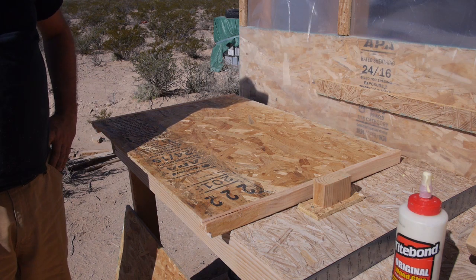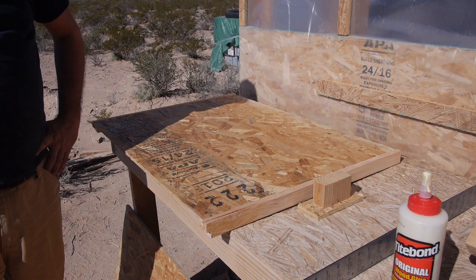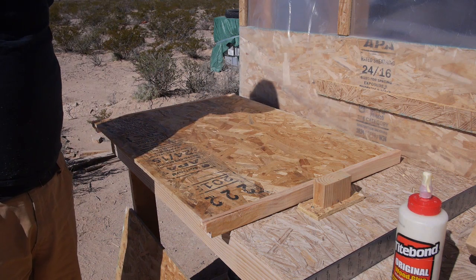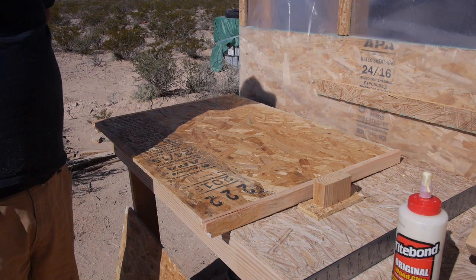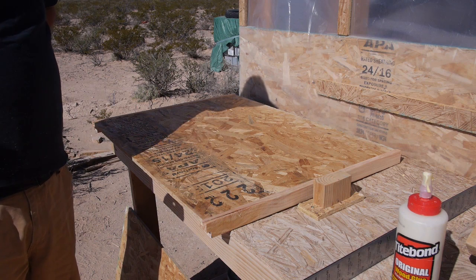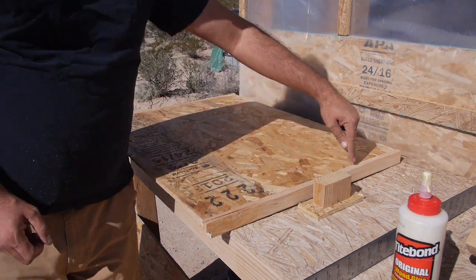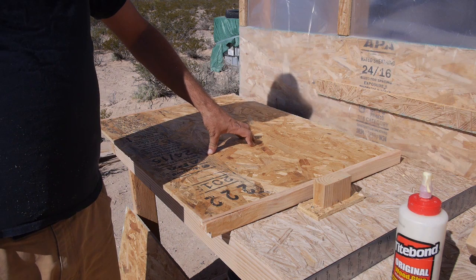I don't have a putty knife, and I really want to use one for getting the next windows out so I don't break the glass. The aluminum frames are really not very strong, and if you're trying to pull the window out when it's still got all the caulking or silicone in there, it's a sealant that is really strong, and I'm pretty sure I cracked the last window I took out. What I want to do this time is use a putty knife and a hammer — get it in there, tap it sideways. Get your putty knife in and just tap, tap, tap, and it'll push the blade along. It's flexible and you can get it in there, and that'll break the caulking loose so you don't tear up the thing getting it out.